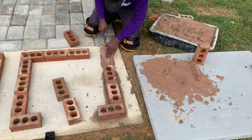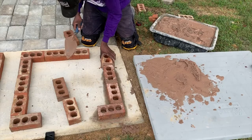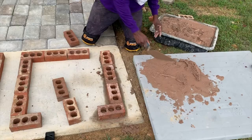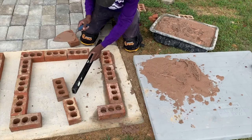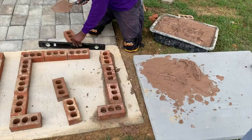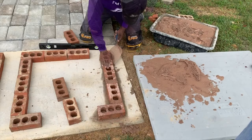I then placed mortar on the concrete slab, making sure to flatten it out so that when you place the brick it's completely covered. When you place the brick, make sure the mortared side attaches to the existing brick. I tap the brick with my trowel to tap it down, make sure it's in place and even with the other brick, then grab your level to make sure everything is even and leveled — no slants. This is very important because a slanted brick on one row will affect the next row. I repeated this process for all the brick that I laid.